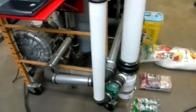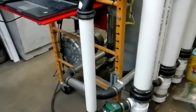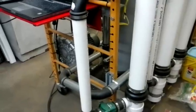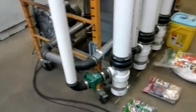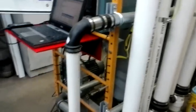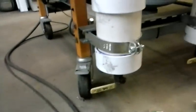This vertical white pipe right here — at this point it's just to pass the gas into the filters, which are also completed and loaded and ready to go. But this pipe is going to be replaced with a series of other pipes, and I'll probably have a valve on it so I could do an unfiltered flare. I could tap off of this pipe right here and do an unfiltered flare, which at this point I can't do because I want to use a separate blower for that. This check valve prevents any air from being pulled out of the filters, or gas from being pulled out of the filters, when I'm doing that unfiltered flare. It goes into the first filter here, and I've got condensation traps in the bottom of all three filters with valves that I can empty them out easily.